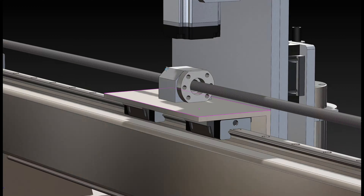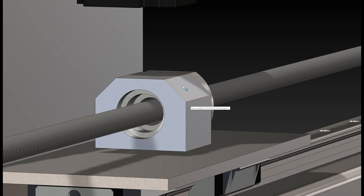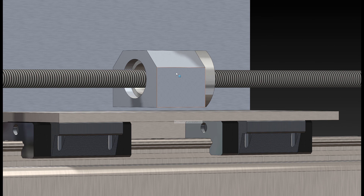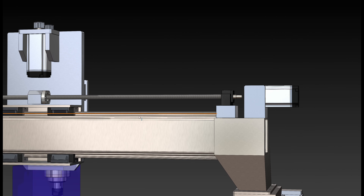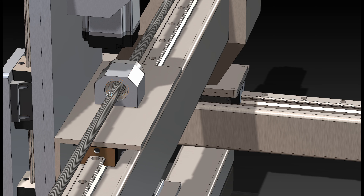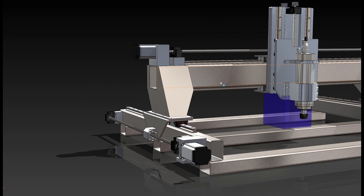I might wait and see if there's a better option. I've seen a picture on the PrintNC forum where someone took a housing without the side chambers, drilled out the threads, and tapped whatever the housing attaches to. That would be the ideal way — just get some long bolts, use the BK12 block spacers for shimming, and simply bolt it down from the top.